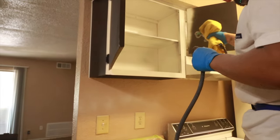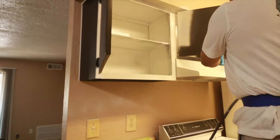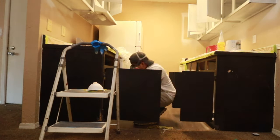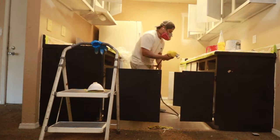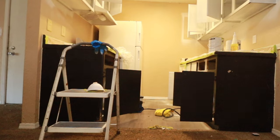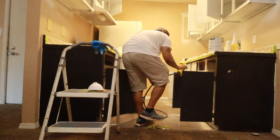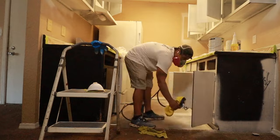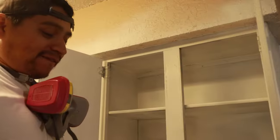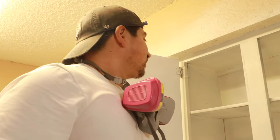The way we do cabinets in apartments is a little different than for a high-end residential job. Since they're not changing the hinges, we're just spraying them — or we'll cover them with tape and leave everything on so we don't have to take things off and put them back on. Then we sand, prep, spray primer, and then paint. I stuck my finger in a hole and there were roaches in it — I hate it here.